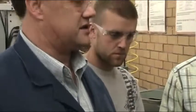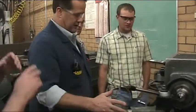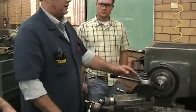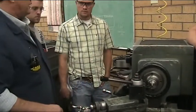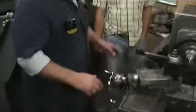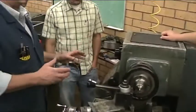If you want to change the spindle speed and you're threading and you want to go faster, let's say, because this is taking a long time. For me, I could actually thread it a little faster. I don't want you to. But let's say you want to change it. If you don't have this half nut engaged and you change the spindle speed, it's not going to line up on your threads anymore. So then you're going to have to jockey all of these around until you've got the tip of the tool right in the thread. So don't disengage this, this, or anything that runs this thing. You can disengage this, and that's about it, while you're cutting your threads.